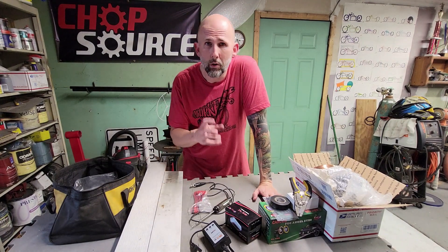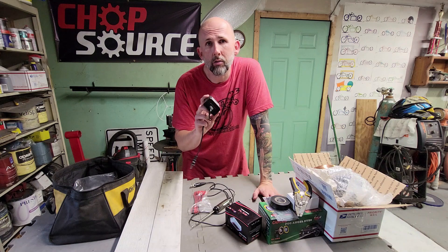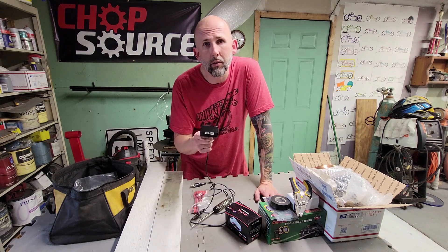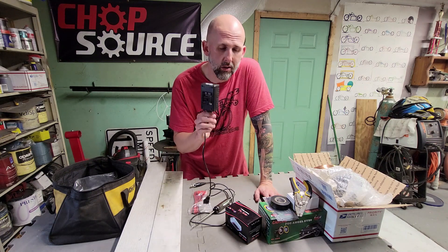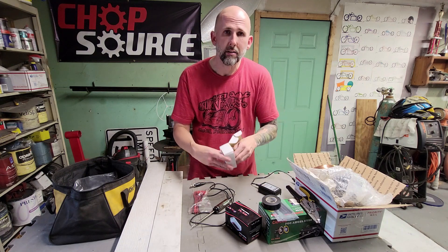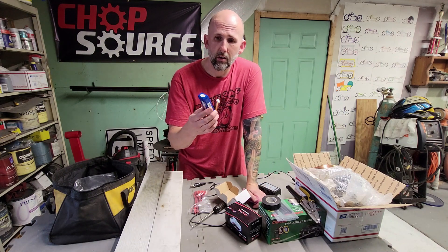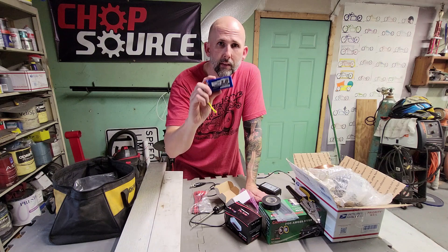The basic things you're going to need to build a custom headlight for your bicycle: you're going to need one of these chargers. I'll put a link in the description so you guys can click on that. Only warning I can give you — these are cheap little China chargers. Do not charge them inside your house; these have been known to catch fire if you overload them. Next, you're going to need one of these batteries — they're made more for RC helicopters, but they're tiny enough to tuck inside the headlight housing. They've been a little scarce on eBay but I'll find the link and attach that too.